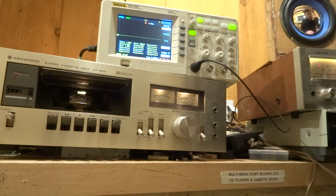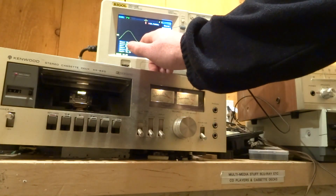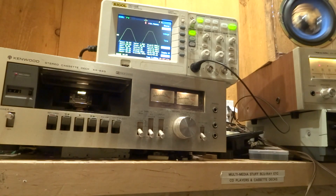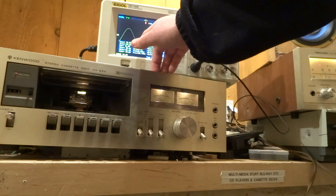I'm not sure how many watts per channel this thing outputs — whoa, it runs right back on though. VRMS: 16 volts. Right there — see it clipping. I'd say that's around 1% THD and VRMS is 24.5 volts. I don't have my calculator on me.